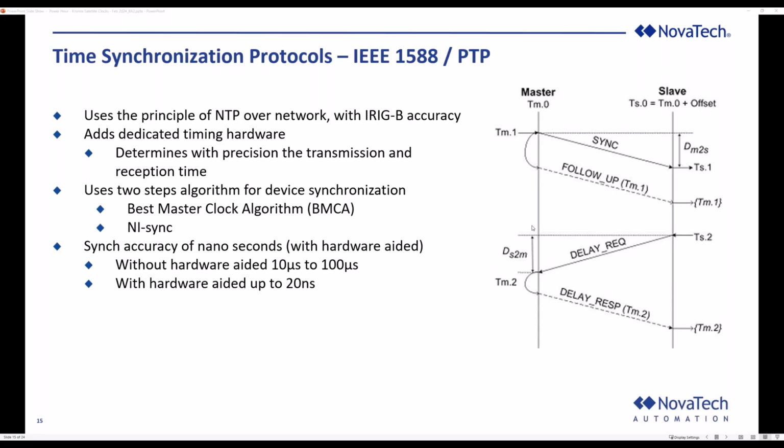One of the advantages of PTP is that you don't need coaxial cables, and you can just run it over the Ethernet traffic itself. This example is very simple, but in a real use case, you might have multiple grandmaster clocks and a bunch of ordinary clocks, and then boundary clocks and transparent clocks. So the topology would be a lot different to what we've just shown. This is just the idea so that people understand how PTP works behind the scenes.